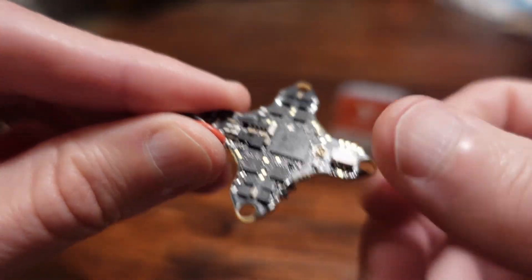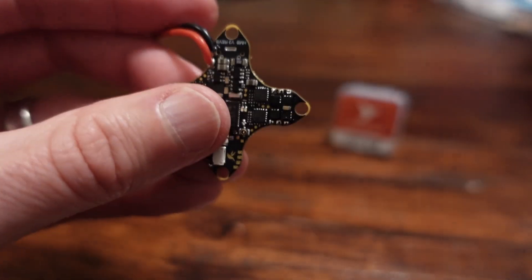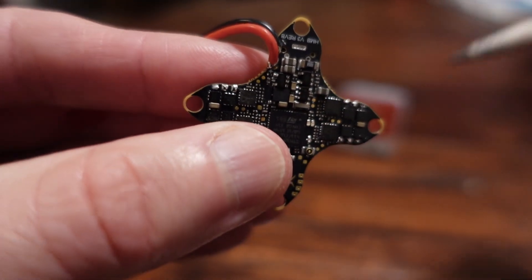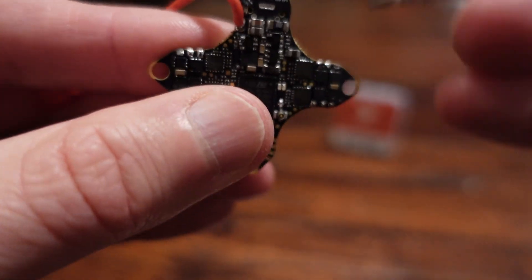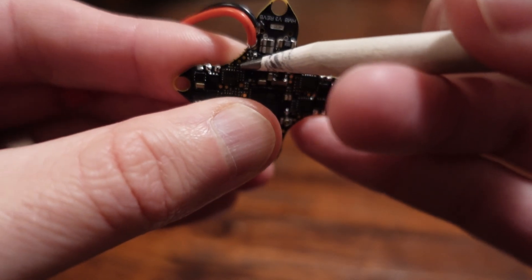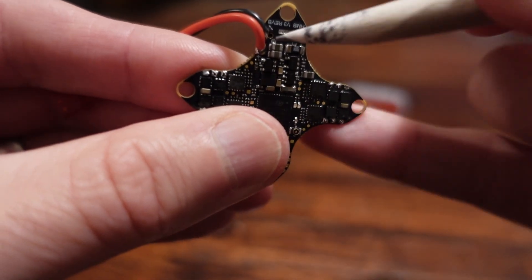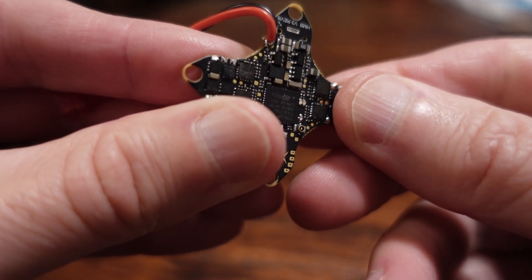But I have a theory about why that happened. To explain that theory, I built this up and it didn't go well — I'll show you why. If we look right here, see these little squares? Those are the FETs. If you look at the FET, it sits really close to your motor solder pads. And do you see these little shiny dots? See on the black edge there — those three little silver dots shining there? Those are the pins for that FET.